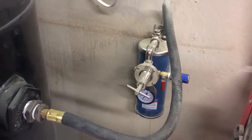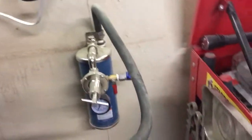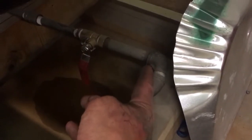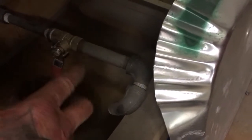I've been noticing there's not a lot of water coming out of the air hose like there used to be, and eventually after using it a while there's no water coming out at all, which is awesome. If you have a compressor, instead of crawling up underneath it all the time, it's a lot easier if you just run some pipe over and then have an on/off valve — you just open it wide open and all the water will dump out.